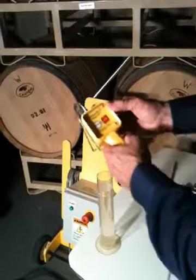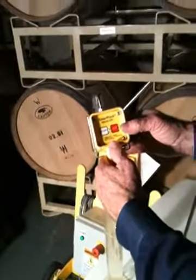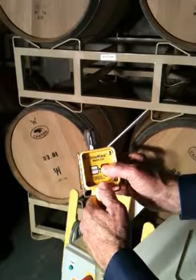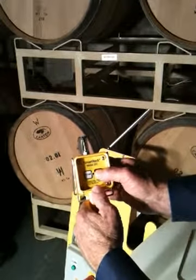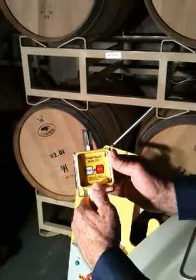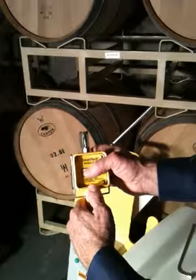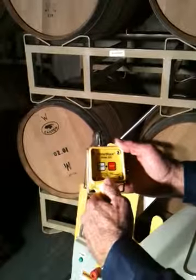The leak test mode, we have to be in the calibrate mode to get into the leak test mode. So recalling what we did, we press and hold the stop button, and it flashes red 5 times and stops. Okay, so now we're in the calibrate mode. Now to enter into the leak test mode, we press and release the start button, and you get a flashing red light. See it flashing? When it stops, now we're in the leak test mode.